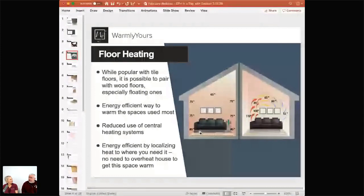What's great about floor heating is that you can also localize the heat. If you're going to be in a specific room, you can make that room warm and let the other part of the house be cooler — you can actually turn your furnace down. A good example: my husband loves birds, so we have three birds and that room always stays at 82 degrees ambient temperature. Each room is zoned on its own control. You can keep a spare bedroom at 60-65 degrees while staying very comfortable in the room you're using the floor heat.